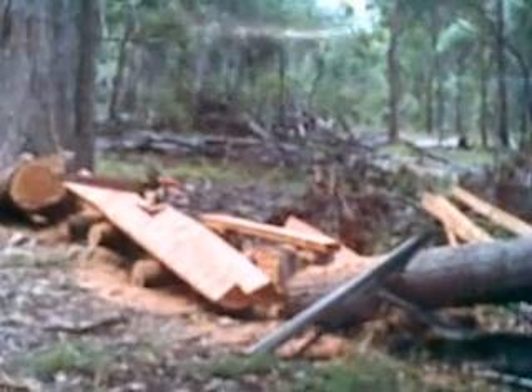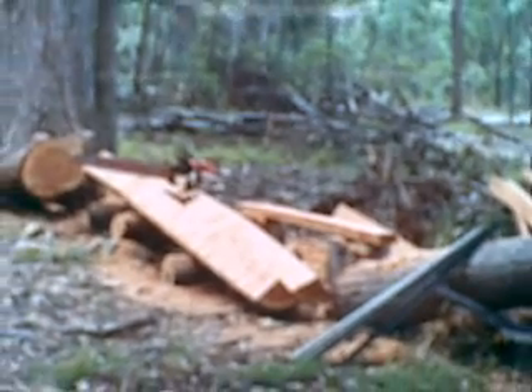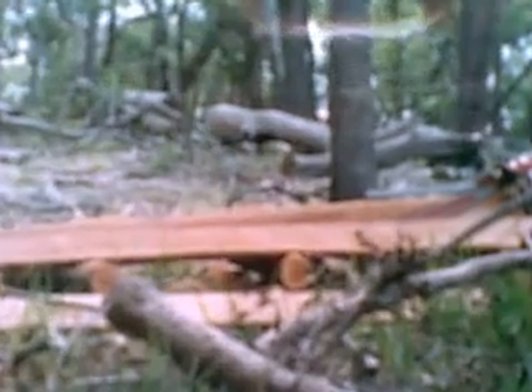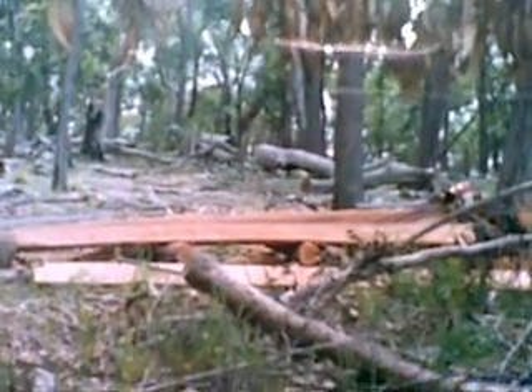When using guide rails and a chainsaw to make flat square rectangular prisms out of windfall timber, it really helps if you know enough to quarter-cut mill the tree. It may seem like a lot of trouble, but quarter-cut milling means that out of each quarter you can cut a rectangular prism that won't cup, warp, twist, or bow, and the sides will remain parallel as it dries out.